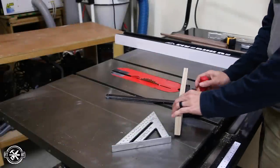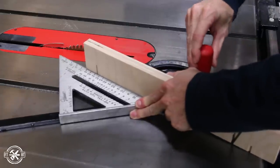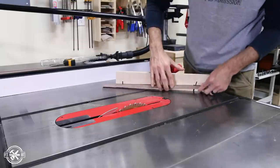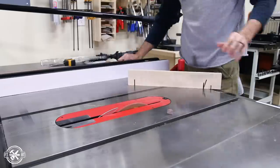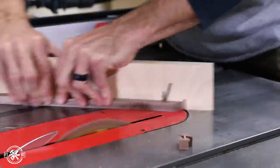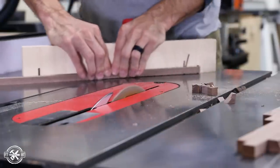The lamp is made of a series of ten 5 inch by 5 inch open mitered frames that sit between the base and the top. To make the mitered segments, I set my miter gauge on my table saw to 45 degrees and made a 45 degree cut on the end of each strip. If you hold the strips in place by hand, just make sure that you're always keeping your hands outside of the red throat plate area and make sure you use caution.